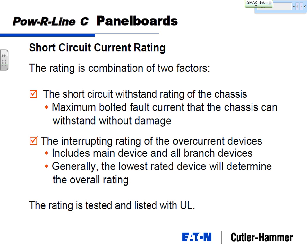One of the ways the arc helps is when the circuit breaker first starts to initiate a trip and starts to open, it may see current ramping up toward 65,000. If a fault occurs and your normal load is 100 amps, you're going to ramp your way up to 65,000 amps, depending on how much impedance you have in the system. And somewhere along the way, maybe at 1,000 amps as you work your way up, you reach the point where the circuit breaker tells itself to trip, and it starts tripping.